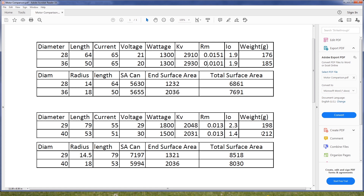What's really interesting here is the surface area. The smaller diameter motor actually has a much greater can surface area along its length, though its end surface area is smaller. Overall, the total surface area is still larger on the smaller motor. If I had to pick between these, I would again base my decision on surface area — being able to dissipate heat through greater surface area is always helpful, especially if you use a heat sink. The larger can surface area of the smaller diameter motor can make a heat sink work better, even though its end surface area is not as large.